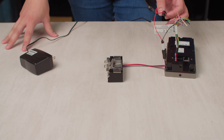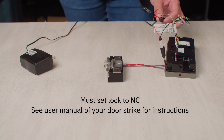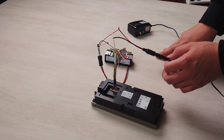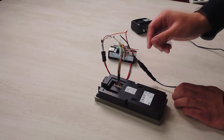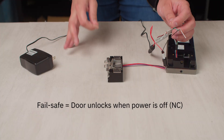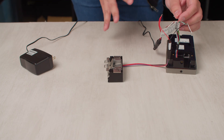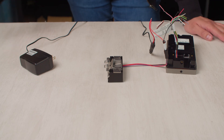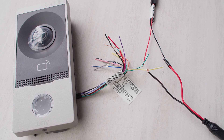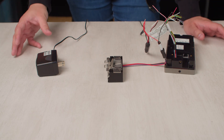As a side note, if you want the door to unlock when the power goes out, you will need to set the lock to NC, which is normally closed. Then instead of connecting the door strike negative wire to lock one normally open, you would instead connect it to lock one normally closed, which is this pink wire right here. This will put the intercom into fail-safe mode, which means the door will stay unlocked when the power goes out. Once you connect the negative door strike to lock one normally open, the wiring is complete — we have a circular loop going from the power supply to the door strike to the intercom and back to the power supply. When the unlock button is pressed, the intercom will bridge these two wires together, completing the circuit and opening the door strike.